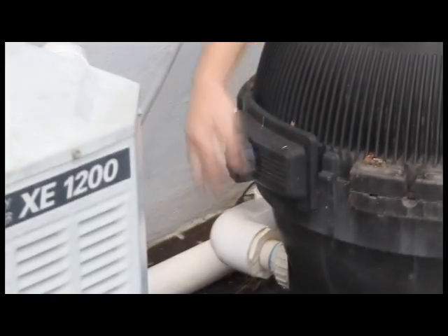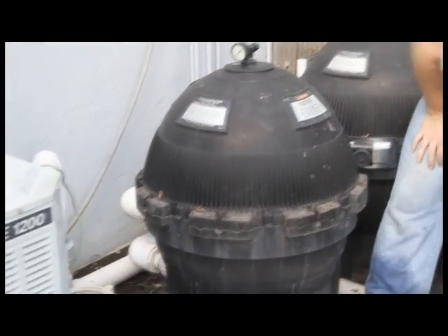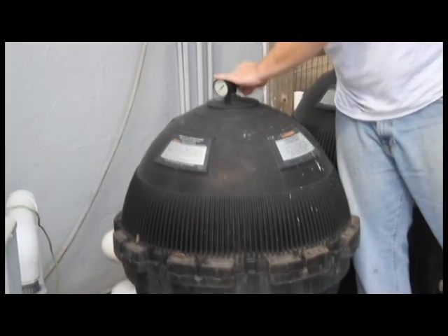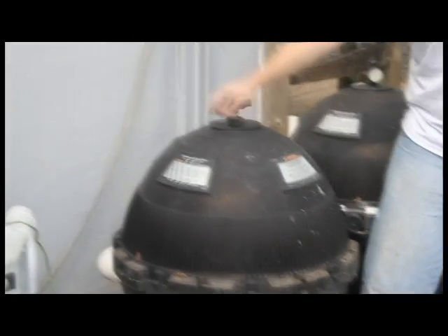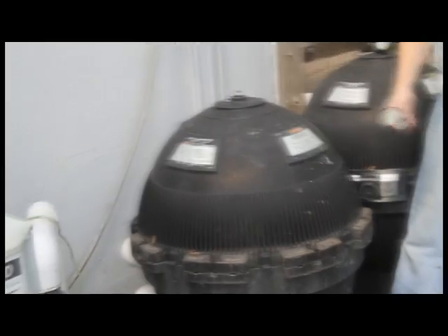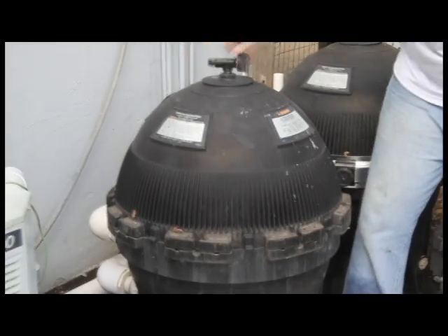Now I fast-forwarded — that's the last clamp I'm removing. When I did this, I put the drain plug back in the filter, so we're going to have to open the air relief. If you kept the drain plug out up to this point, you can ignore this. However, if the drain plug is back in, you'll have vacuum inside the filter tank, and you'll need to allow air in as you try to open it. To actually lift the filter tank off, it has molded lift points all the way around — I'm lifting on the point right there, and the top half is off.